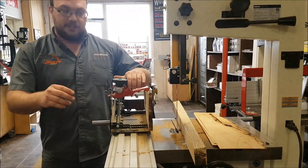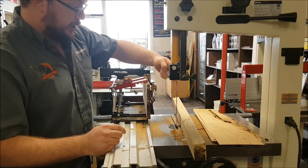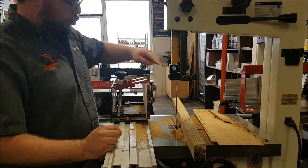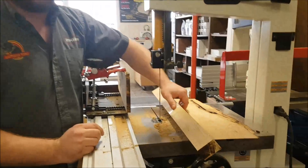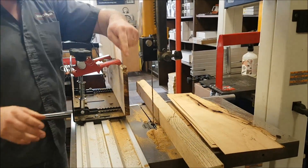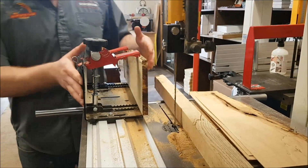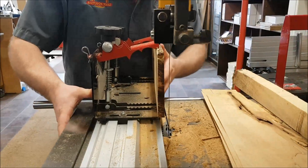That means, while this side is sharper, the blade is going to want to cut better in that direction. What I just did here is basically what you're doing with a fence. So now that blade is going to drift. Watch — it should be cutting into the side of my ripper, away from the bandsaw. Let me make another cut to show you this.